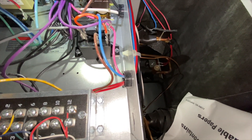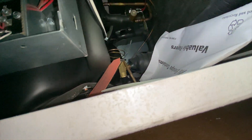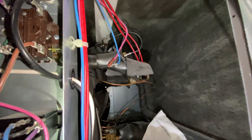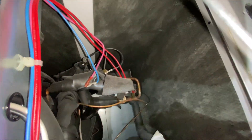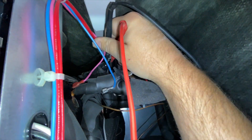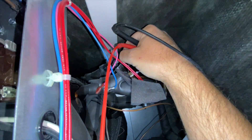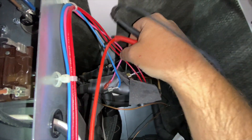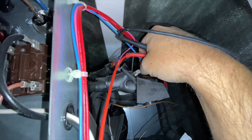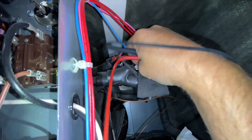So it's locked out for some reason. I pushed in the contactor and everything turned on, so I'm wondering if maybe one of the pressure switches is tripped. We'll go ahead and check our pressure switches. I have it on continuity — if I get a beep that means it's closed. That one's good, and that one's good. None of our pressure switches are open, so that's not our issue.